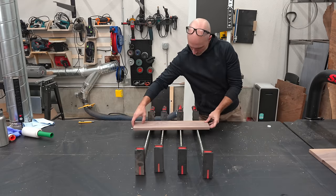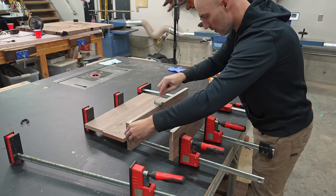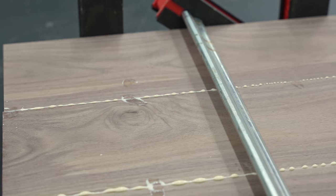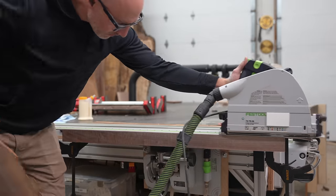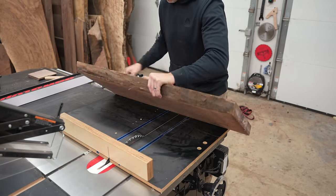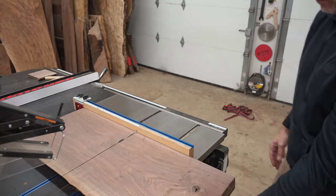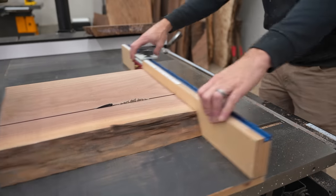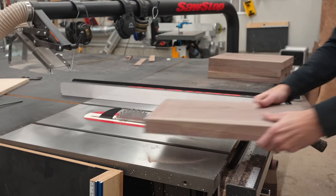After I got all of my boards jointed and ripped to the proper width, I was ready for the glue-up. For this one I'm using Titebond Original. One of the old-timey woodworkers I know told me not to use Titebond 3 on walnut — he said there's been some problems with it delaminating over the years. I've never personally experienced that, but it's something I think about because this person has done a lot more glue-ups than me. If I was a less ethical YouTuber, I would have titled this video 'Scrap Wood Project,' since technically all of these pieces are leftover scraps from larger projects. However, I'll accept that 2-inch thick, 12-inch wide black walnut is not generally considered scrap in the woodworking world. And I'm giving this project away — when I say I'm giving away a scrap wood project, that doesn't sound nearly as cool.